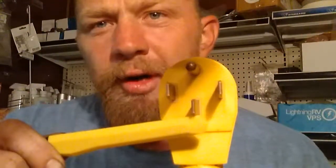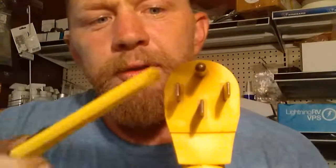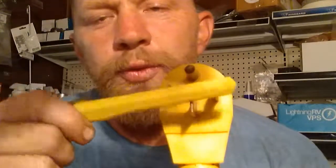But if you haven't done it yet, you're looking at it, maybe this video will help you out a little bit. I'll explain it a little bit to you. If you look at your big plug, your top and your bottom will be your grounds. Your 2 sides will be your powers. So from here to here you'll have 110. From here to here you'll have 110. Between the two you'll have 240.